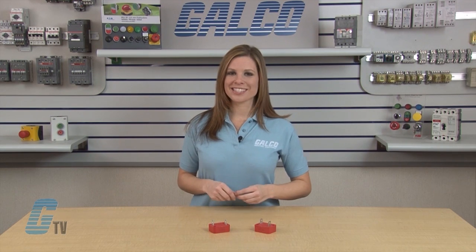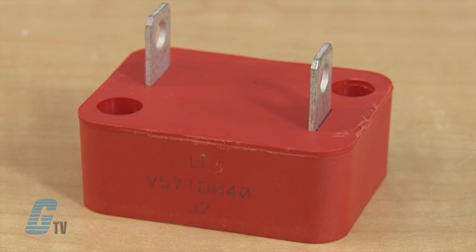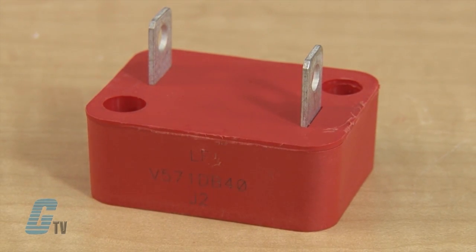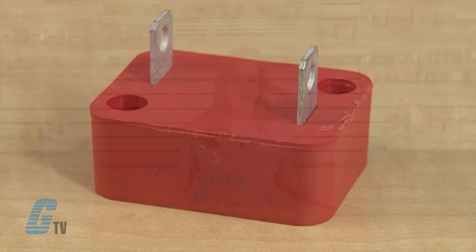This is the amount of energy which may be dissipated for a single impulse of maximum rated current at a specified wave shape, with rated RMS voltage or DC voltage also applied, without causing device failure. The varistors have a wide operating voltage range with rated RMS voltage at 130 volts to 750 volts.